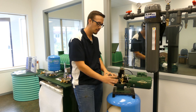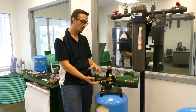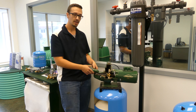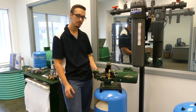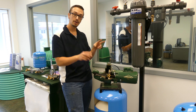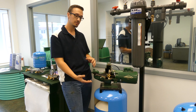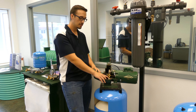The main reason you need one is that with a jet pump, you have to keep the body of the pump — we've got a cutout here — full of water in order for the pump to get traction and start pumping. What the check valve or foot valve does is keep the water in the pump and prevent it from flowing backwards out of the pump's intake, keeping the pump what they call primed. Having a primed pump is the best and most surefire way to prevent the pump from running dry, which causes wear and tear.